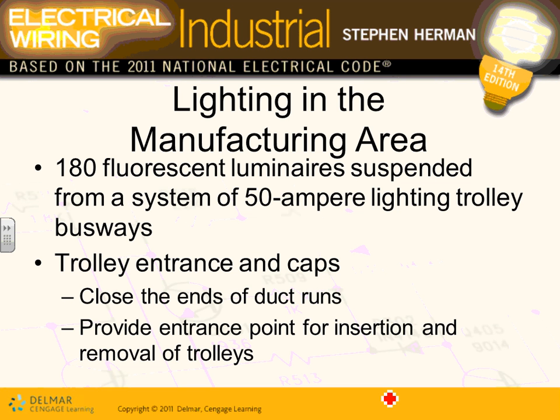To add salt to injury, my friends, they also have another trolley busway on the manufacturing floor, but this one has no tools plugged into it. They're lights. 180 fluorescent luminaires are suspended from a 50 amp light trolley busway.